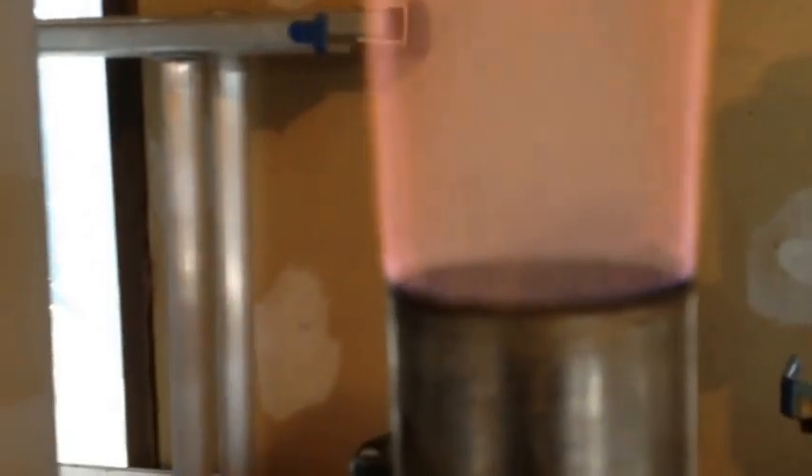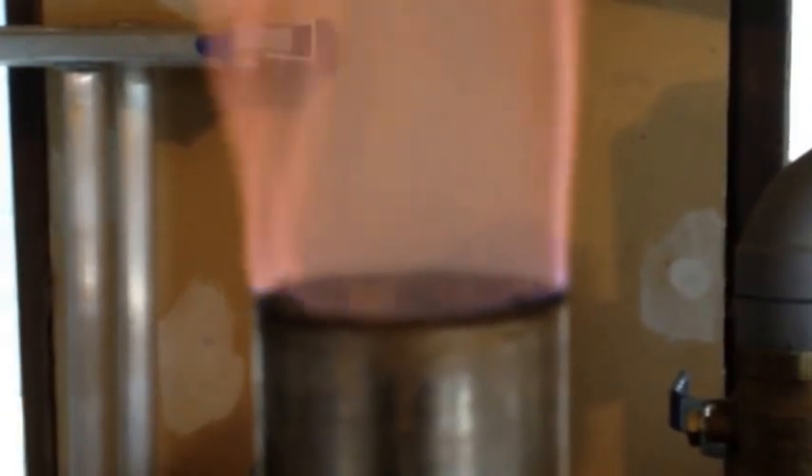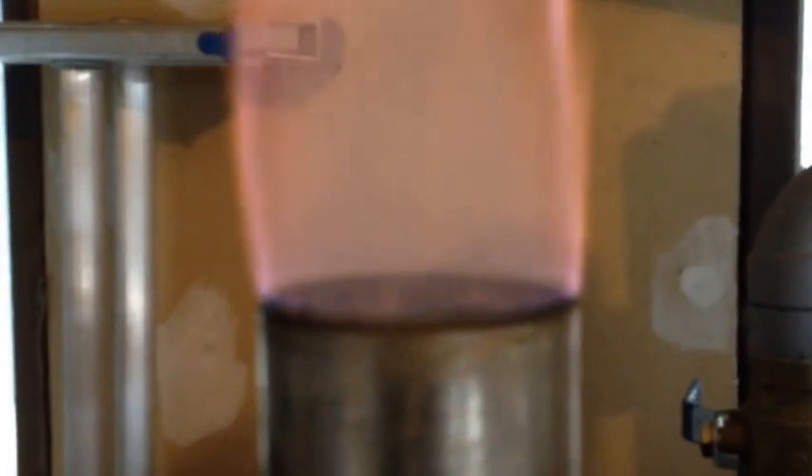What I might do is check the other side. You can see how the flame is just kind of bouncing on top like there's gases - that's telling me I got to shake the grate or there is a bridging issue right now. See how it just kind of jumps up? Eventually the flame is going to put itself out. I'm going to go back, open that up, and let's see what we can do. It might be a bridging thing.